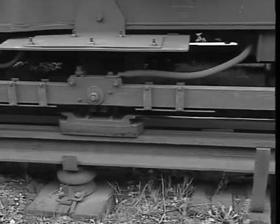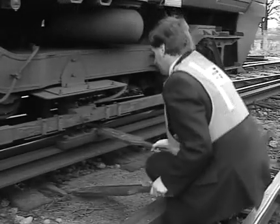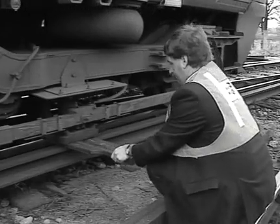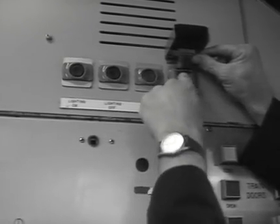The class 455 is a four-car unit having four collector shoes and adjacent ribbon shoe fuses, one on each side of the leading and trailing end bogeys. The class 456 is a two-car unit with identical shoe and shoe fuse configuration. The emergency procedures for paddling up, shoe fuse renewal and dealing with damaged shoe gear or fire are in most respects the same as for the 1963 stock. However, instead of an auxiliary isolating switch in the motor coach, the class 455 and 456 are equipped with auxiliary trip and set buttons in each driving cab.